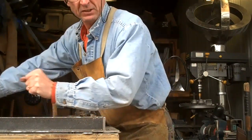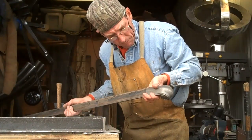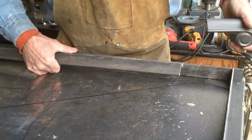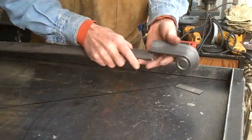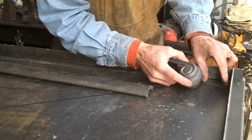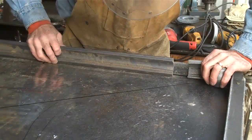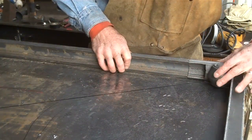Alright, we're just taking a minute to get set up here, put some reference marks on the table. We're going to go ahead and weld on some of these volutes before we actually make our cuts, because I pulled my measurements from that point. When it comes time to weld on these volutes, to get them nice and straight, I'm going to use this piece of angle iron on my table. The railing is just a little bit wider than the actual volutes, so I'm going to use a spacer, set that up on a spacer, get it squared out, turn the railing up on edge, get it all lined up, and then just come in here and tack it before we weld it off.